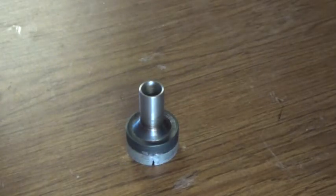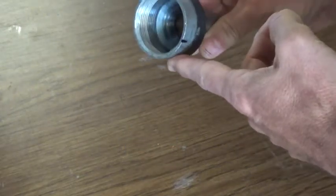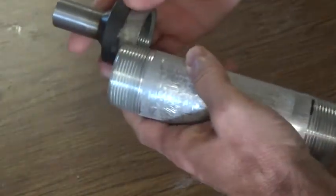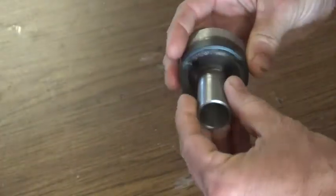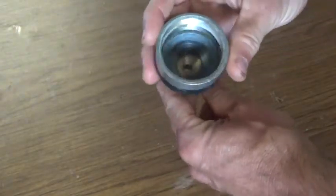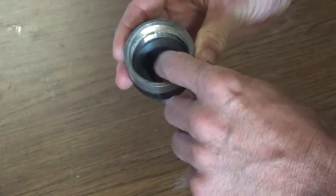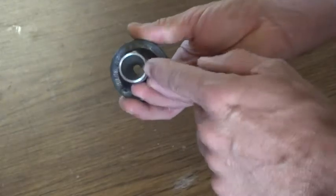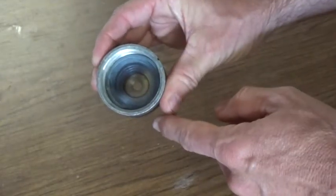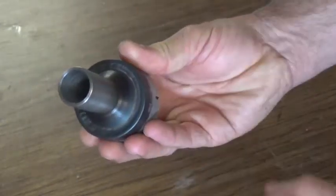The final piece is our nozzle assembly. This also used an inch-and-a-half steel coupling that was cut down to size to fit well onto our pipe nipple. On the lathe, I made this nozzle assembly — it has a 35-degree half-angle for the convergent side, a 12-degree half-angle for the divergent side, and a number 18 nozzle in the center. That was also then welded onto the coupling assembly.